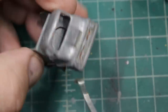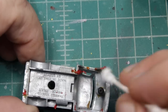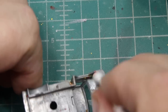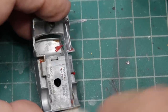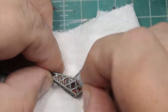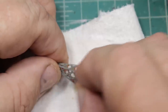One thing I noticed is the aircraft stripper you buy now has a big warning on it. George has talked about this — they changed the formula and it still works, but I've got to be honest, it doesn't work as well. I find myself having to do this a little bit more, which is something I had to do a lot when I was using the citrus stripper, which I like, but this stuff works so much better. And that's fiddly work, getting all that stuff out of the lattice work.